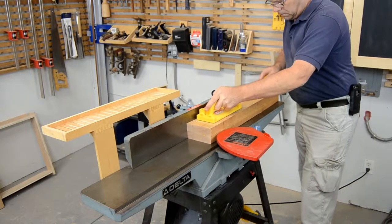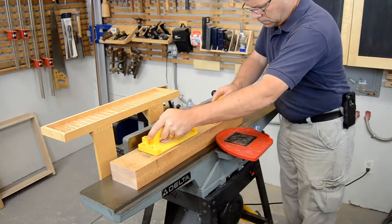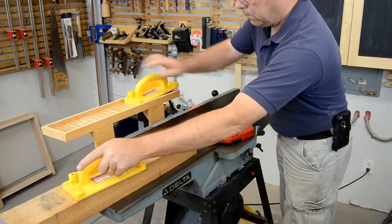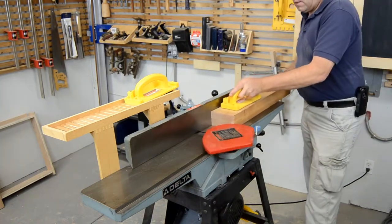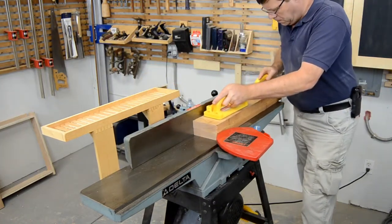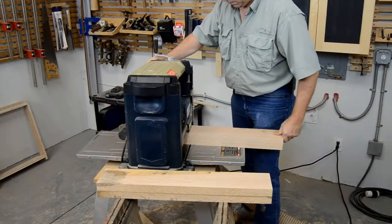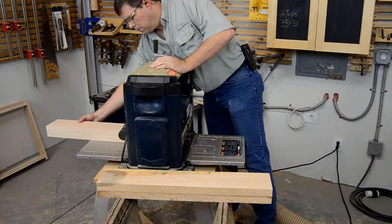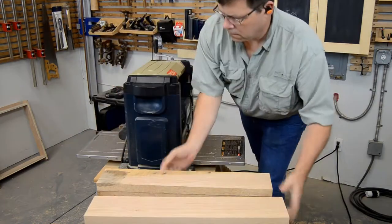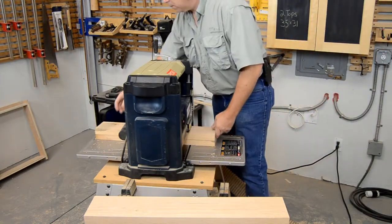The two feet and the four legs all end up at two inches thick. I'm using all five-quarter material and just did the glue-ups needed to make the legs and the feet. These glued-up blanks went through the typical process of jointing, planing, ripping, and cross-cutting to final size. I processed the legs and the feet together so that they'd be exactly the same thickness.